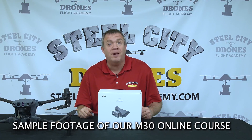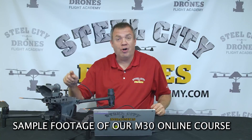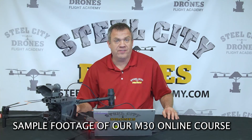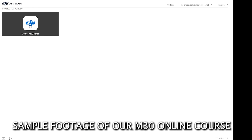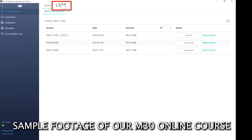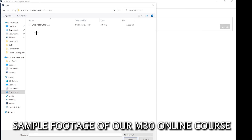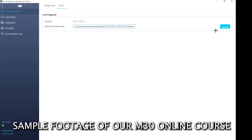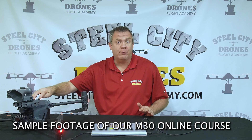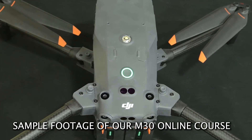In this video, we talk about setting up and installing the CZI LP-12 loudspeaker and spotlight combination for the Matrice 30. Turn on the M30 and open the DJI Assistant 2 by double-clicking the DJI icon. Under the device list in the upper part of the screen, it says LP-12 — click on it. You'll see the current firmware version. Browse for the downloaded file, select it, and hit upgrade. After updating, you must shut it down and reboot — if you don't restart the M30, it will look like the update didn't take.